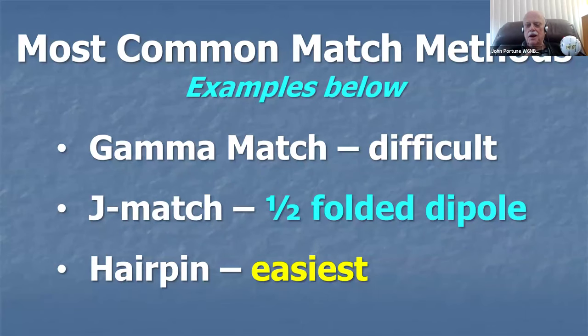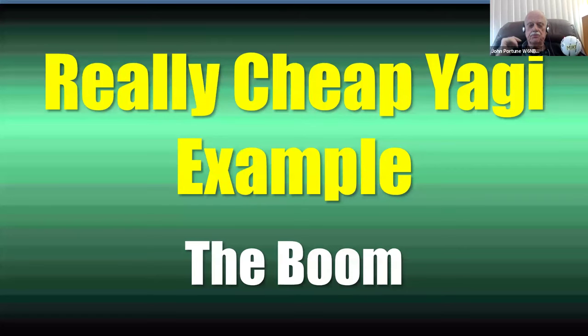So let's look at some common match methods. I'm going to give you some examples. There are three common match methods for doing Yagis for homebrew, or maybe otherwise. And I'll show you the one I like the best, which is the hairpin at the bottom. But just in case you want to build yourself a Yagi, and they're so easy to build, as you'll see here. Gamma match, I don't like it. It's very difficult. The J match, good match. It's a half a folded dipole. And the hairpin, which is the one I like the best because it's the easiest. And I'll give you some examples of it here in the next few slides.